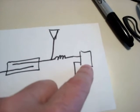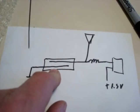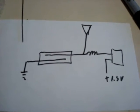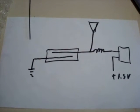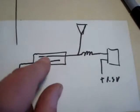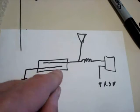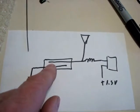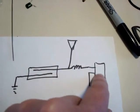This represents that relay I showed you on the chest. And then one and a half volts. Basically this glass tube is filled with granulated metal. I've hand-built a lot of coherer tubes — I've used aluminum, I've taken a quarter and filed it down to a powder and filled the tubes up. You don't want the tube packed tight. When it's full of the granulated metal it doesn't conduct normally, but as soon as it gets energized by a radio frequency it starts conducting, and it stays in that conducting state.